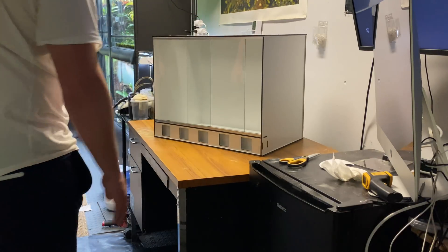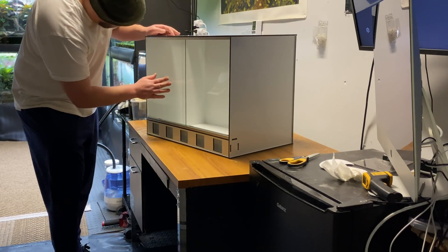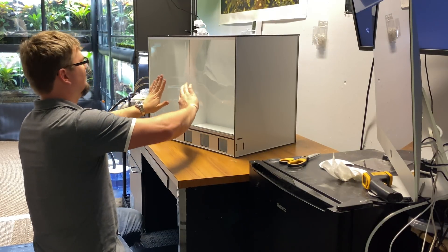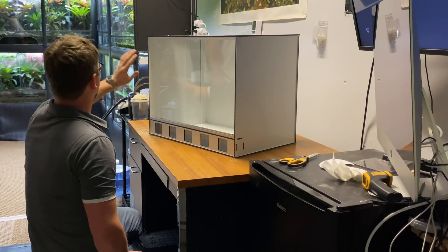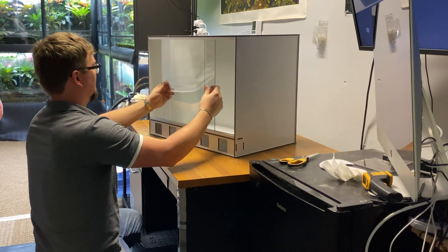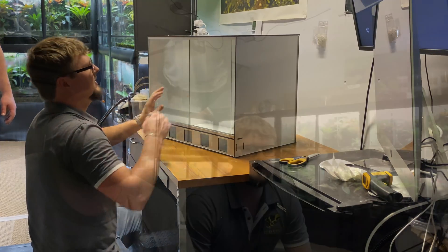And that's the tank fully assembled. It slides easily — there's a piece of material in the bottom of the rail that creates a better sliding surface for the glass and raises it just enough that you can remove the glass without taking the top off. The tolerance is very tight. On the sides I'm more than likely going to route an eighth-inch channel into the material so the glass doors dip back when open, accounting for any slight variation in glass cut.